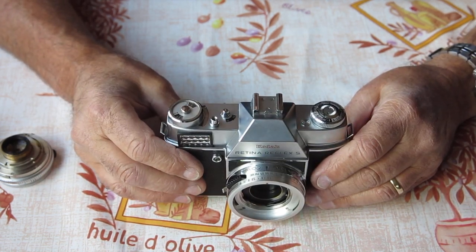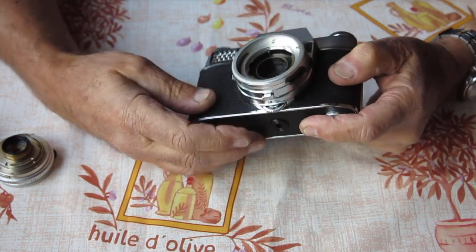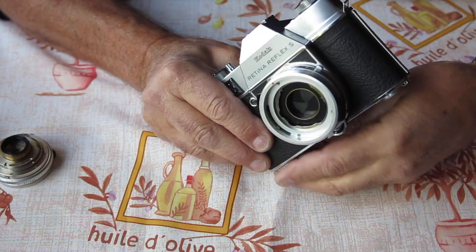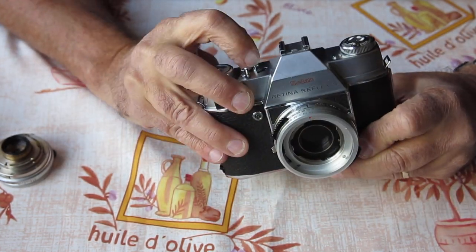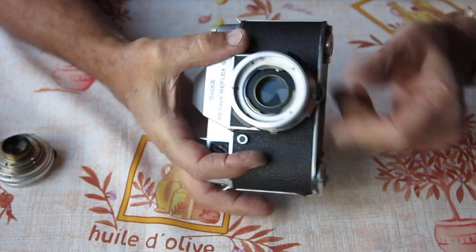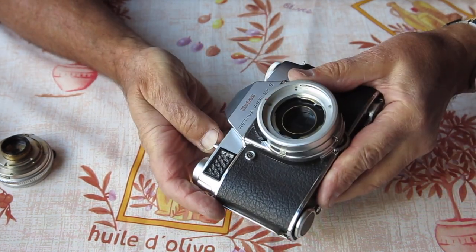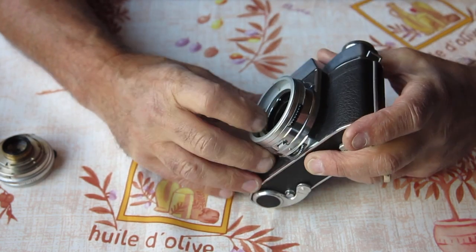Meter is lively, but nothing. It looks like the shutter's cocking, judging by that tab that moves down to open the aperture on your lenses. Oh, now it's not. That was a very nasty feel. Something is broken. I suspect a damaged cocking rack. We shall find out. Could just be a sticky shutter, but I'm deeply suspicious. I don't think that is moving far enough.